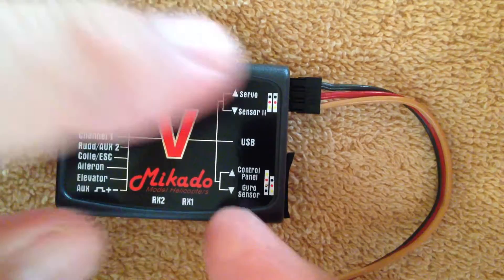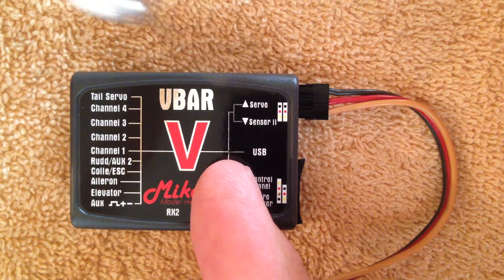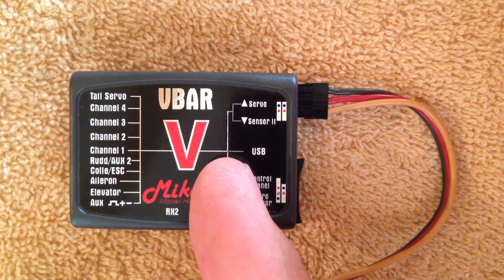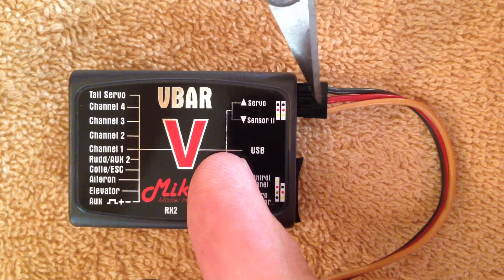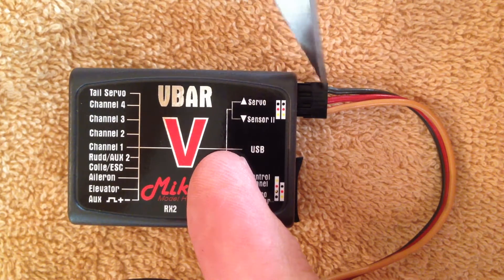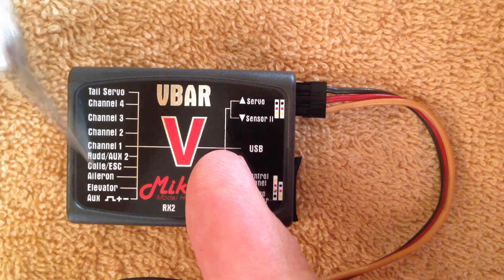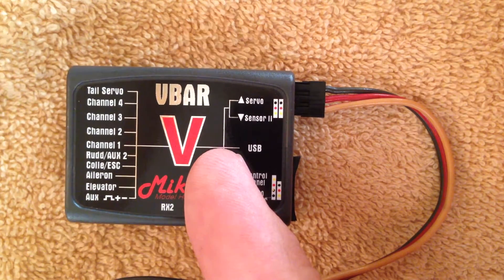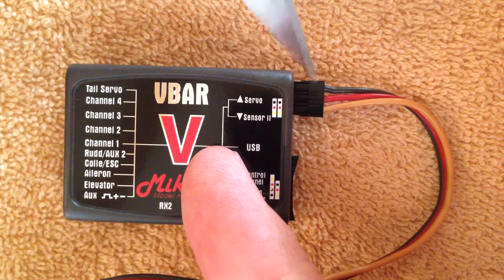What we're going to need to do is, instead of extracting the voltage from the sensor port side of the V-bar, we need to extract it from the other side — the normal system bus where you'd be plugging in all the servos. We'll need to leave the signal wire on the sensor port side, and then have another plug on the main bus side of the V-bar to get the required voltage, which will be 4.8 volts or greater, depending on what system voltage you're running.